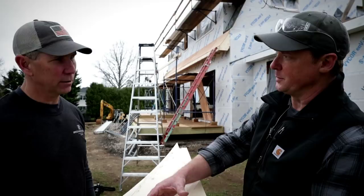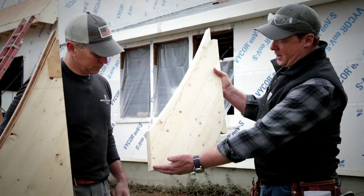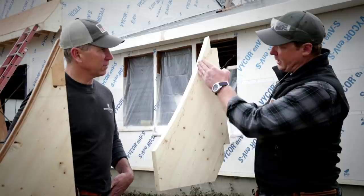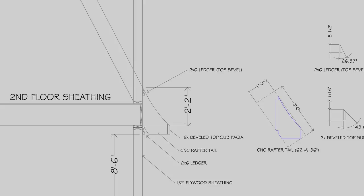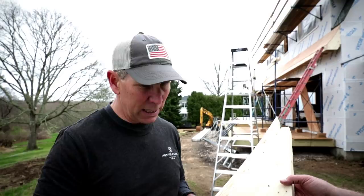The fabrication is a pretty complicated profile because we've got to have the fascia and soffit here - it's got to hit the sidewall but then we really need this swoop. So we design this detail in AutoCAD, pull it right out of the drawing, create a drawing for this piece, send it to the CNC, and it talks to the router head and just makes the exact shape.